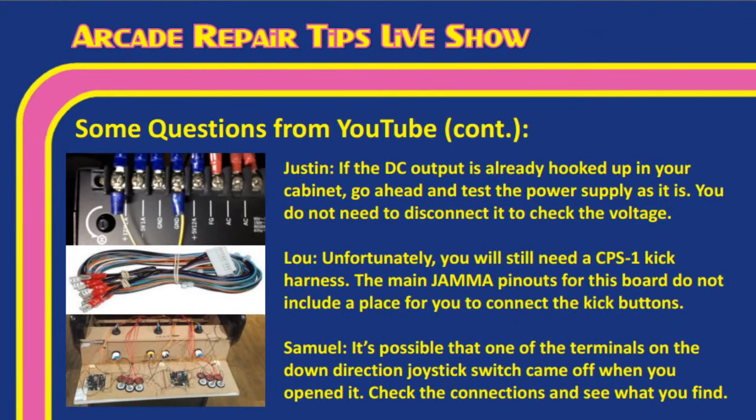And so, Justin, if the DC voltage is already hooked up in your cabinet, just go ahead and test the power supply as it is. That's what we do, Tim. You do not need to disconnect it to check the voltage. You can check the voltage as it is with it hooked up. And if you're going to do that, go ahead and check that voltage at the board level as well to make sure that you're getting good voltage there.